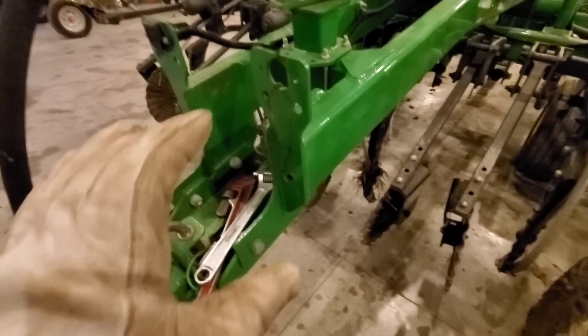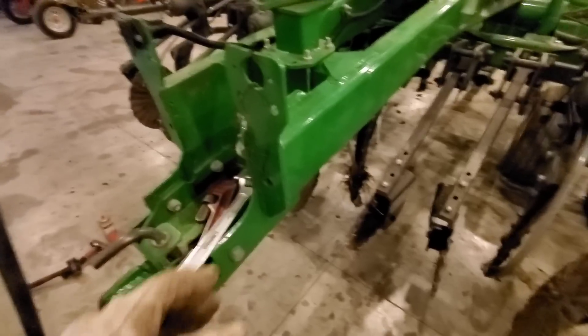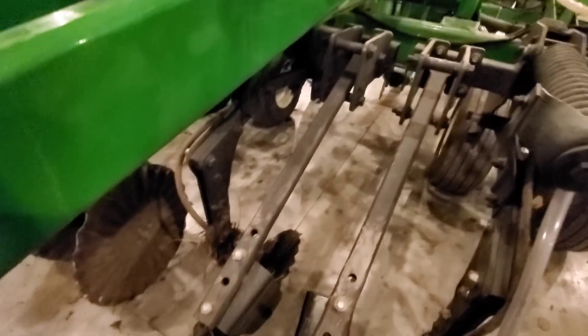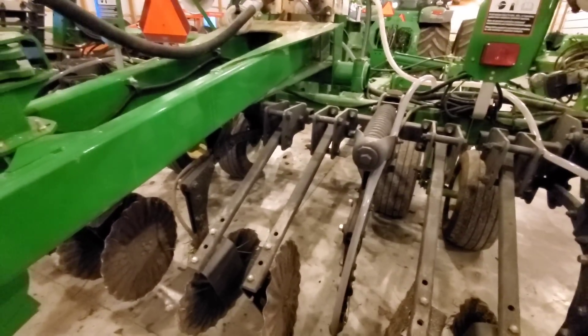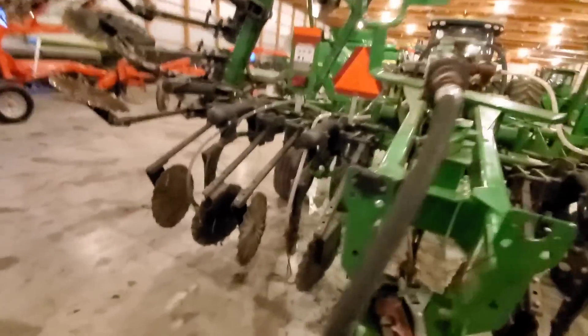One other small difference between the C and S Medium is the rear hitch. This rear hitch is gapped apart instead of being one box tube down the center. The reason it's gapped is so the shank can float up and down in between it — these float up and down around it. It's pretty tight tolerance. On a 12-shank S Medium, that would be a single hitch, just one box tube down through the center.